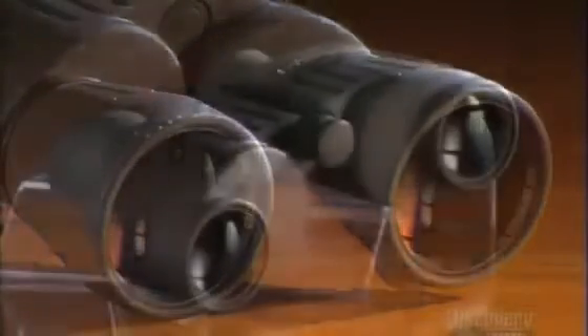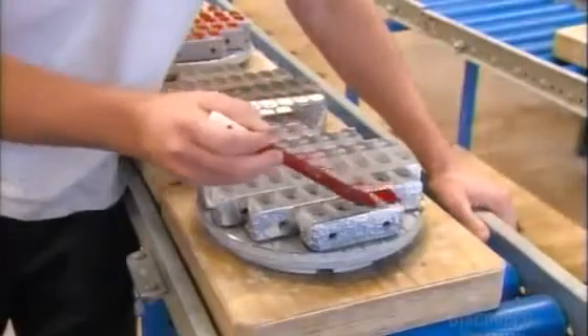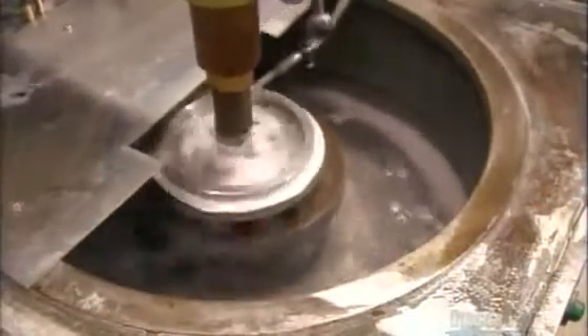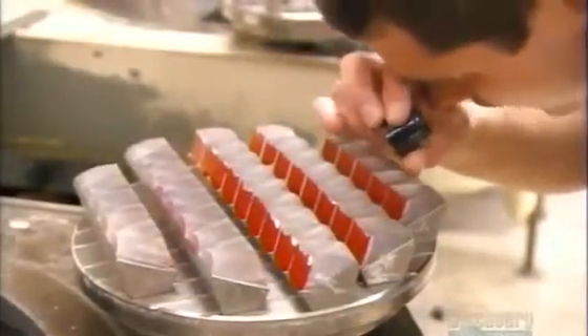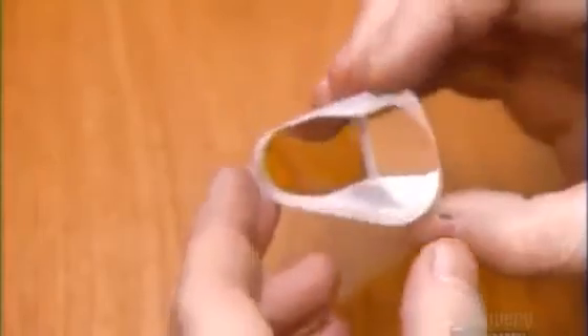The objectives are curved, causing the image to appear upside down. To turn it right side up, each binocular half needs a glass prism. Using UV light activated glue, workers mount several prisms on steel plates that take them through a series of grinding and polishing steps. Protective paint prevents any dust from contaminating the pristine surface. Grinding with diamond dust removes mere tenths of a millimeter of glass. Polishing with an even finer abrasive removes another one one-hundredth of a millimeter. At the end of it all, the three sides are perfectly flat, minimizing reflection — critical for making the glass see-through.